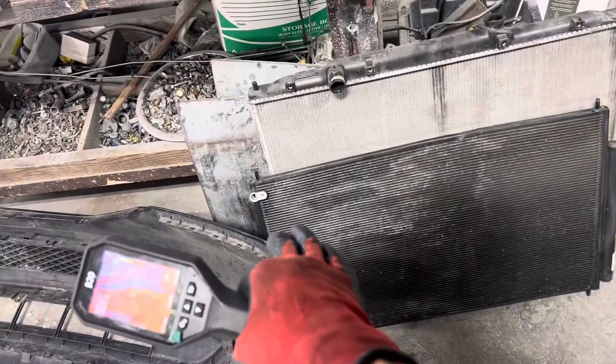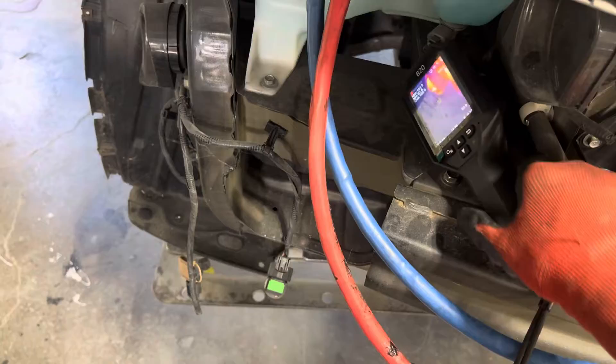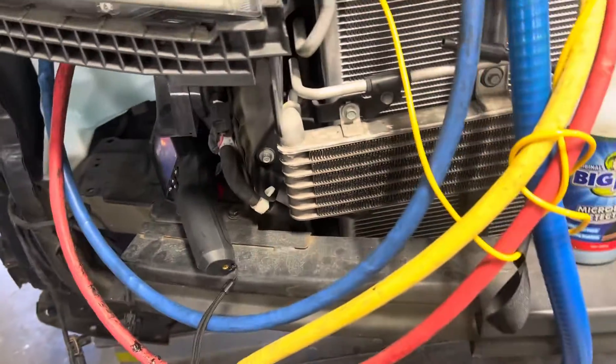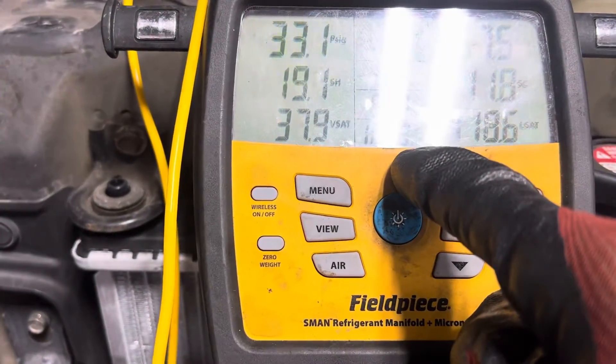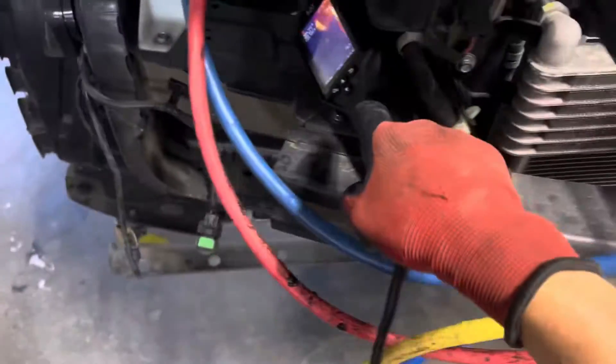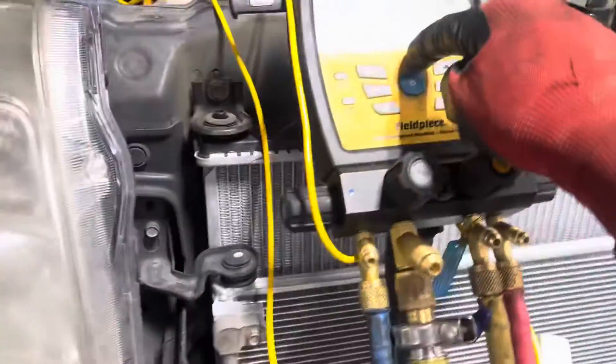It's really nice when you're taking temperatures right off of flat black if you're using this. But don't rely on photo, thermal imagers, or infrared — I've made many videos on why not to rely on those. Let's get the temperature. You can see the temperature right here. I'm clamped on 106 — this said somewhere around 106, 107 right down there. So it's within one degree, both of these on the liquid line with my clamp.